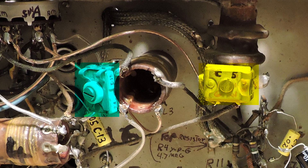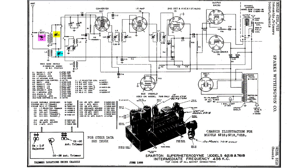I did miss one while I was over there, and that is C4. So I called Chuck back and said, put the radio back on broadcast band and tune to 620, and see if C4 is peaked. If it's not, it will increase. And of course, if it's already peaked, it won't make any difference.